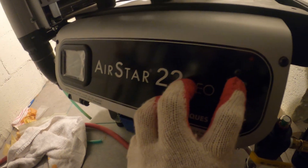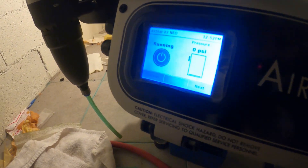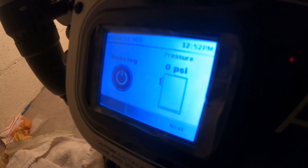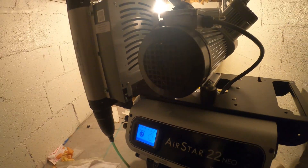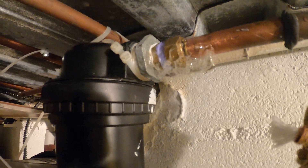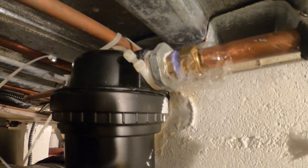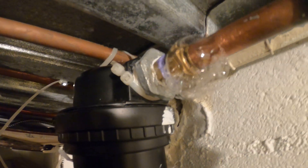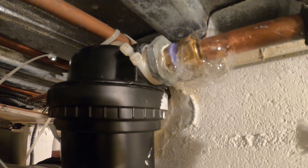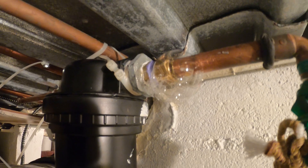Let's start this thing and check for leaks, build up the pressure. All right, we're still leaking. I've got to redo this connection — this thing is completely bad. As I'm spinning the nut, the compression fitting is spinning — I can see that it's messed up. So I'm going to redo that part of the piping and we're going to be out of here. For now I'm going to shut this down and bleed out the air.